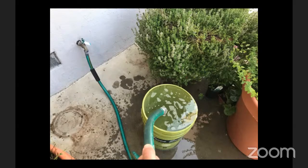So we very rarely see houses that go all the way back to the 1920s and 30s that have not needed to replace their plumbing. But houses that were built in the 40s and 50s that still have the original galvanized piping, sometimes there's so much rust and corrosion on the inside of those pipes that the pipes have actually gotten quite a bit smaller than they look like on the outside in terms of where the water can run through. I used to rent a place that was the exact situation.